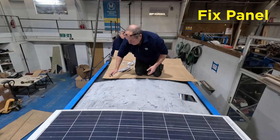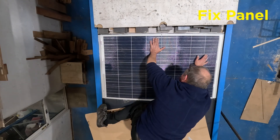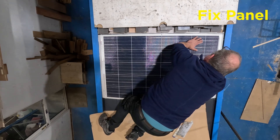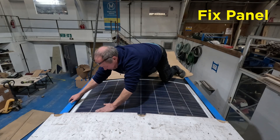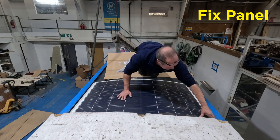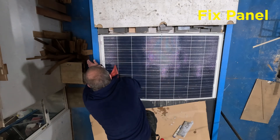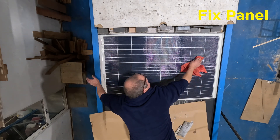Because of the adhesive we're working against the clock, but at the same time we mustn't over-bend the panels, because there is a risk of putting a hairline crack in the wafers and reducing their efficiency. This adhesive is very, very sticky. Wipe it off quickly from any unwanted places and remember to keep your hands clean. Another tip for a good-looking end finish is to keep the panels all in line.